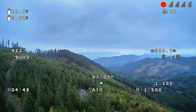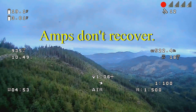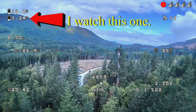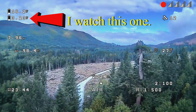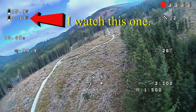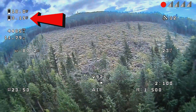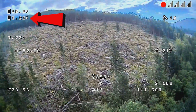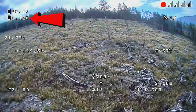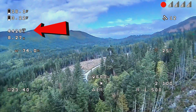I prefer to look at the average cell voltage rather than the entire pack voltage. In my mind it's easier to track numbers like 4 volts, 3.5, 3 volts, 2.75. Also, if I switch between a 4S, 5S, or 6S pack, I'm still dealing with the same thresholds and don't have to worry about the total number changing. So I always look at average cell voltage.